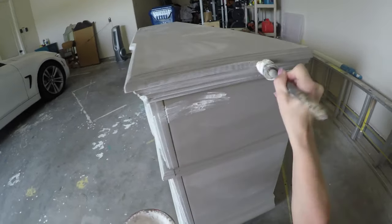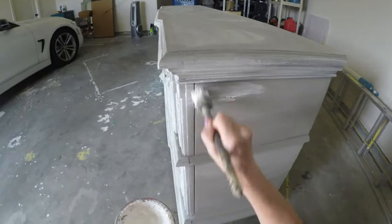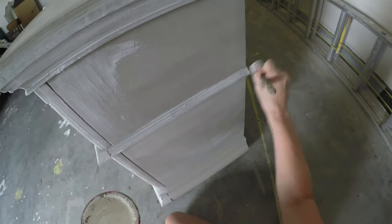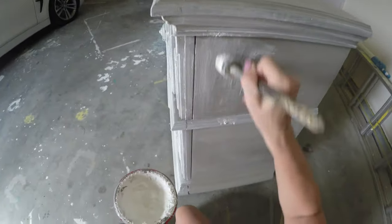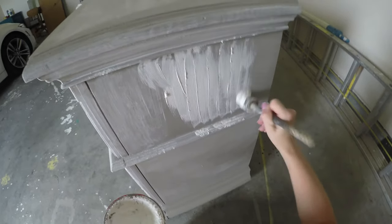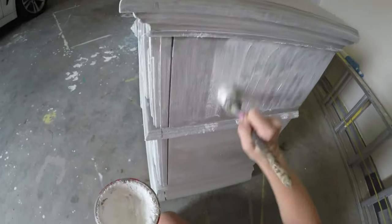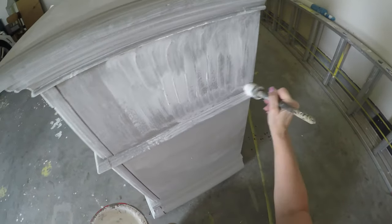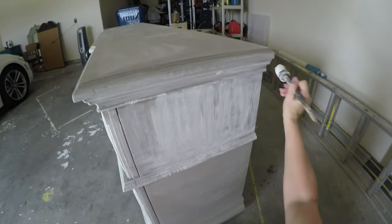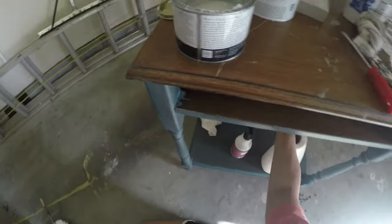Even though I did the drawers with a slightly different technique, the overall look is pretty much the same, and mixing the two products together saves you a whole extra step. I'm applying the wax-paint mix going with the grain of the wood — in this case the grain moves downward while the trim goes the opposite direction. I push it in firmly, then I'll take a towel and wipe back all the excess. The main thing is to use a brush to get into all the cracks and crevices and really push the mixture into every groove.